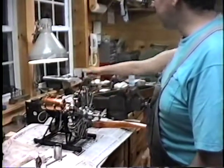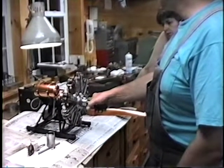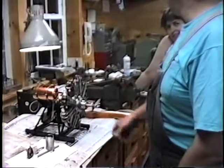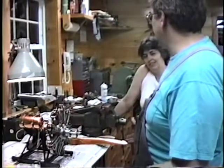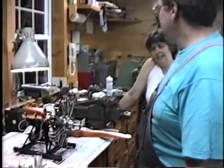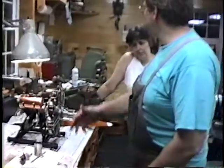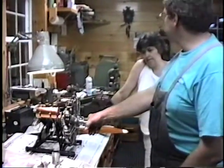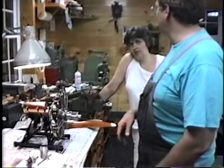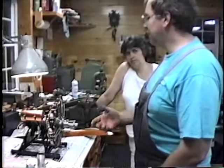The pilot could throttle this one. The early ones were not throttleable — they used to control the speed of the engine by killing the ignition. When they would start it up, it was going wide open. So if they were going too fast, they would push the button and it would shut the motor off. And because of its rotating mass — it's its own giant flywheel — it would coast for 30 seconds. Before it would completely stop, they would let go so it would pick up a little more speed, then they'd kill it again. That's how they controlled the speed.